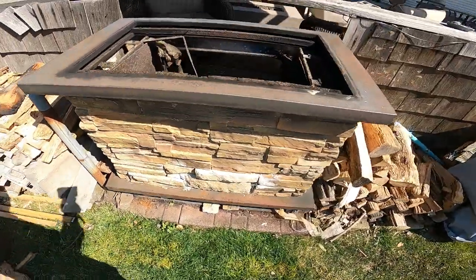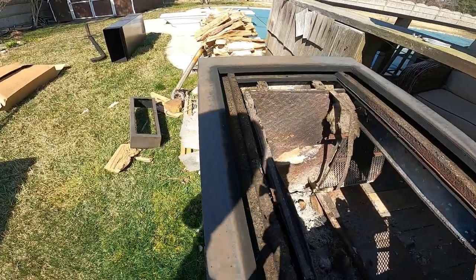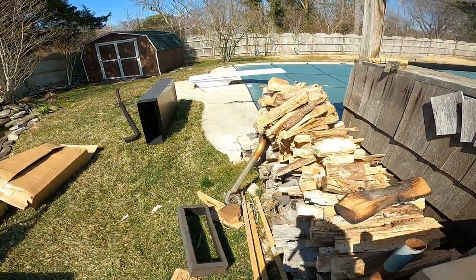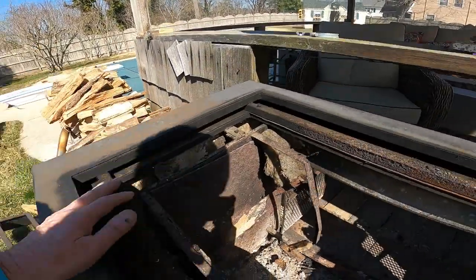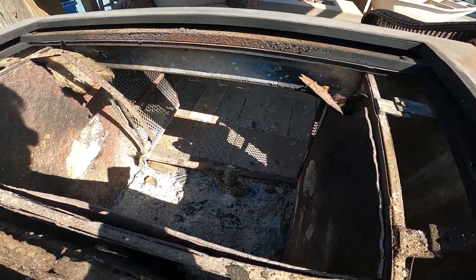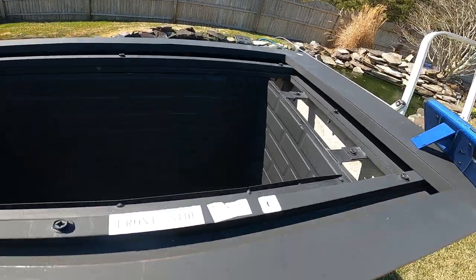This firebox has been rebuilt a couple of times. You can see the diamond plate here that I welded in to make a new firebox. And I put that firebrick there that I purchased at Tractor Supply inside of here just this last year. I found out — wow — it makes a world of difference. It radiates so much more heat, and I think it will also protect this flimsy little stuff in here.